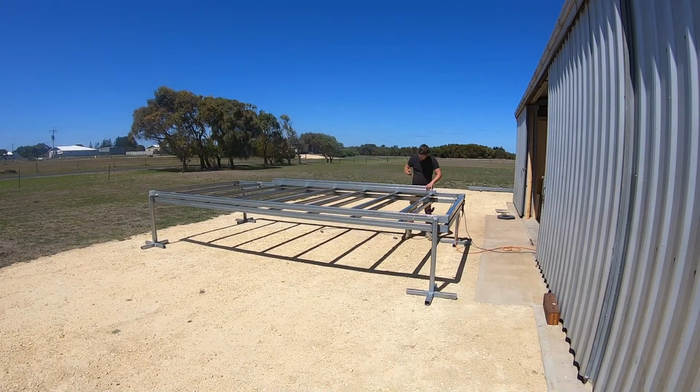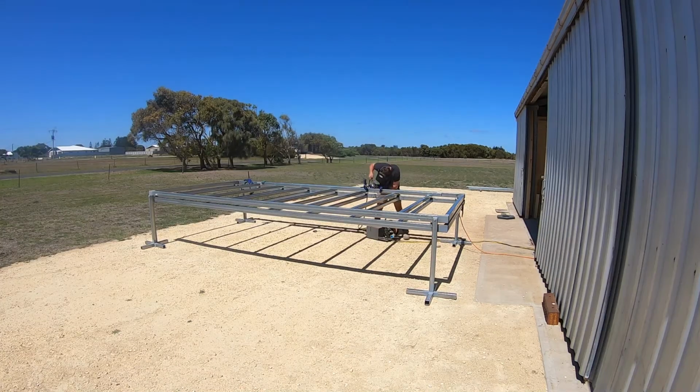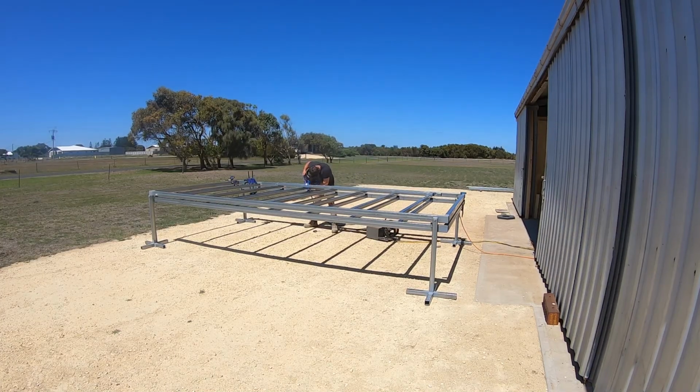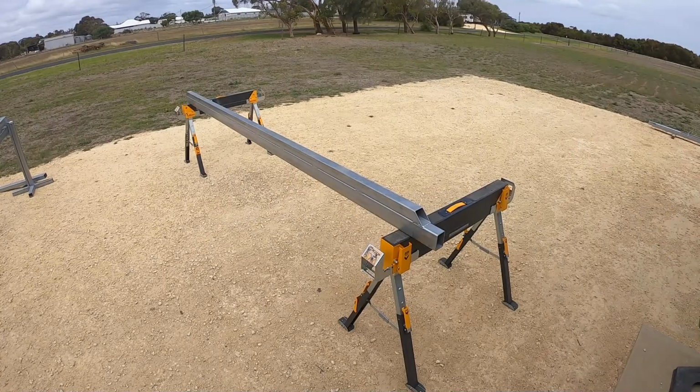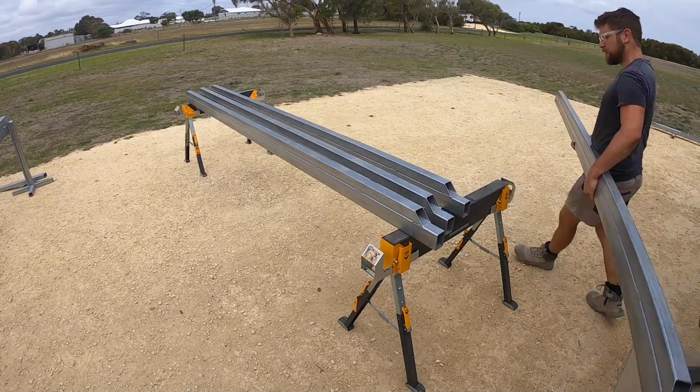The drawbar rails are made out of 2 pieces of RHS stitch welded together. I welded the ends together and then worked my way along the rail doing 50mm welds every 300mm. I flipped the rail after every weld to keep the heat distribution even and prevent warping.